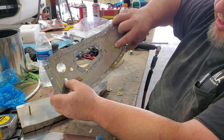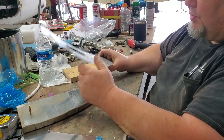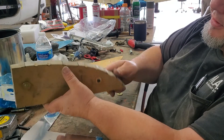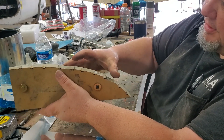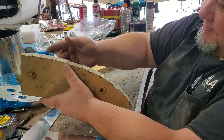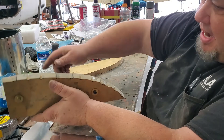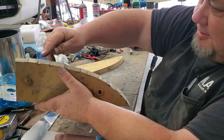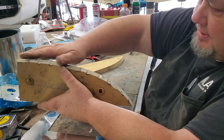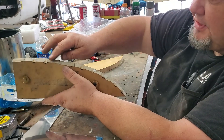With the new flat pattern, the only holes I'm going to drill are this one here, and then I'll drill the center of this one as a number 10 or 3/16 hole to fit over the bolts. You can see I have some scallops in here for the shrinking — when this gets folded over, the material has somewhere to go. You put these little scallops in there, just like the factory did, and that helps keep this edge somewhat straight. If I have to, I'll put this in my shrinker.